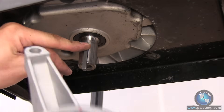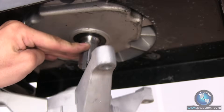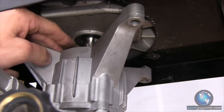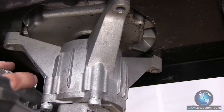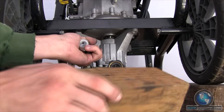Now for the installation of the pump. You will want to slide the shaft key into the groove of the pump shaft slot, and then slide it on up until it makes contact with the bottom of the frame or the spacers, if spacers were necessary for your installation. Line the holes up with the frame and engine, then prop the pump up with a 4x4 or something similar to keep it from sliding back down the shaft when installing your bolts.